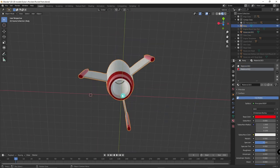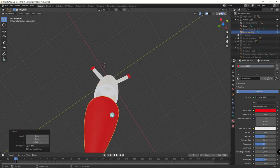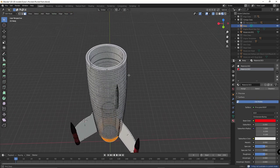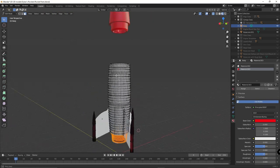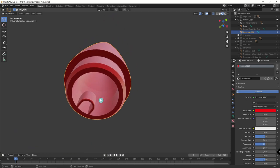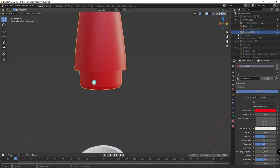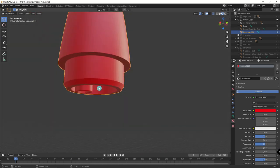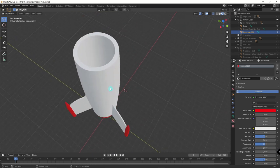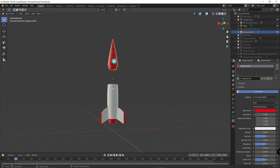Looking at the design — I already showed you the engine compartment, the fins, the body, and then the nose cone. The body is mostly hollow. I probably could have thinned out the walls a little bit to help with weight. Then the nose cone — I did the same kind of style as my RG class rockets where I have a hollow nose cone with the shock mount pre-built into the nose cone, which works well. The nose cone comes off very quickly and the shock mount is attached to it, and it doesn't protrude from the bottom of the nose cone extension. So it doesn't take up too much space, because packing wadding and the chute in here was a pretty tight fit.